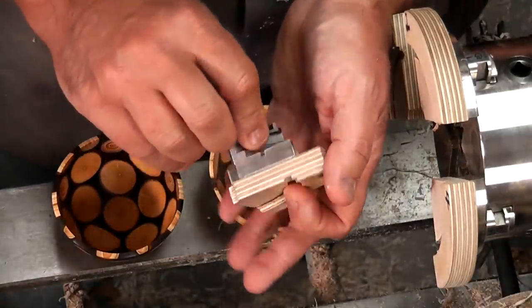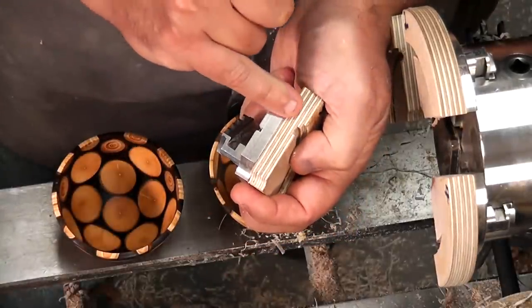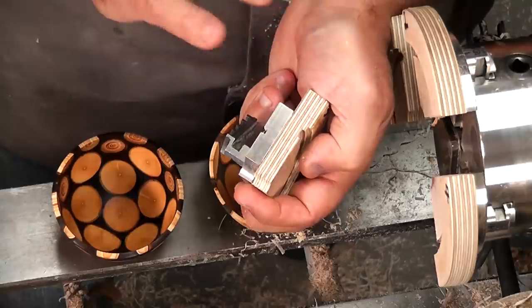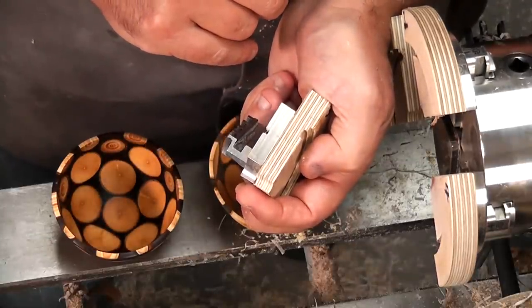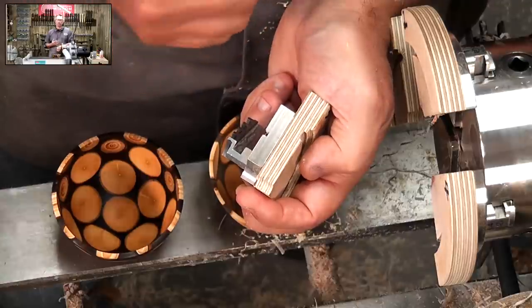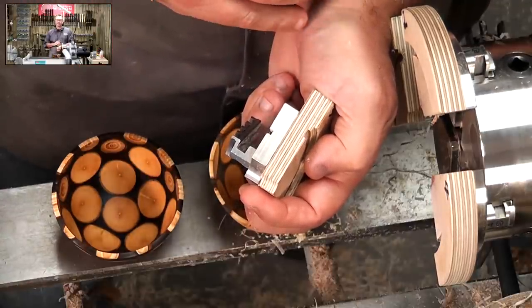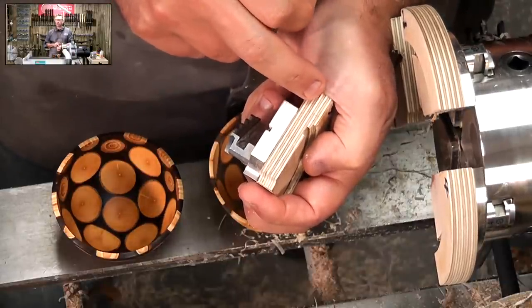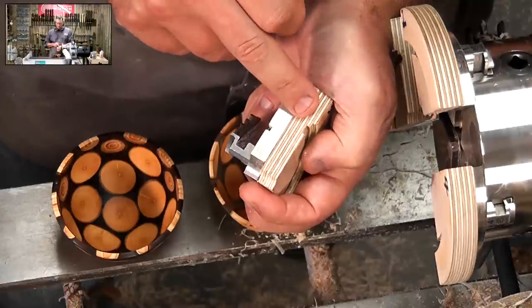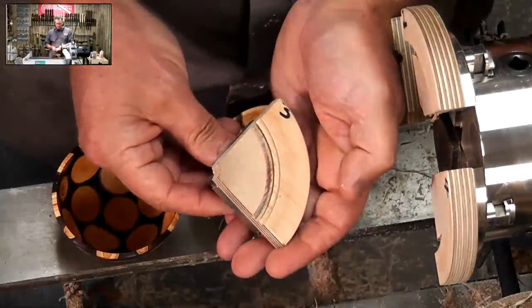So you have to be fairly wise as to where you place your grooves, or go for thicker pieces of ply. Ply is better than solid timber because ply doesn't have a weak spot. It's obviously a laminate. Don't use MDF. It's not strong enough. It delaminates very quickly. So good quality plywood without the voids. So don't go cheap ply. This is birch ply, this one. It's solid all the way through. And they will last me a long, long time.